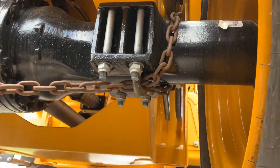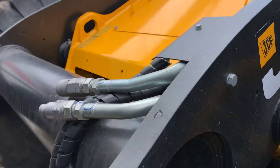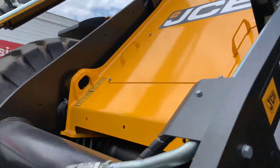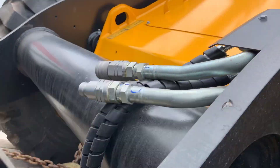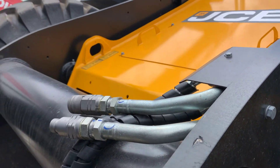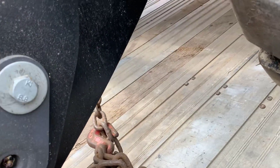Just wrap the axle, chain it, and then cross it on the side. Because if you go over here, you've got different places things could go wrong. You can actually see the hydraulic hoses. If you try to go through there, you've got to run over the hoses. I don't do that and I don't suggest doing that. A lot of times the way they're set up, the hooks are set up toward these arms — don't go all the way down and block it off.